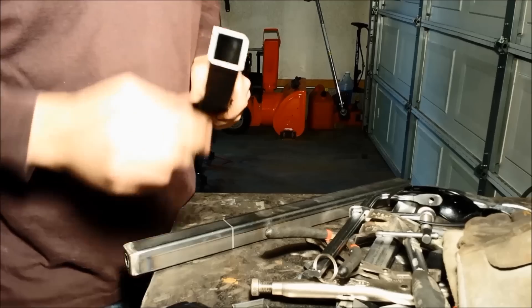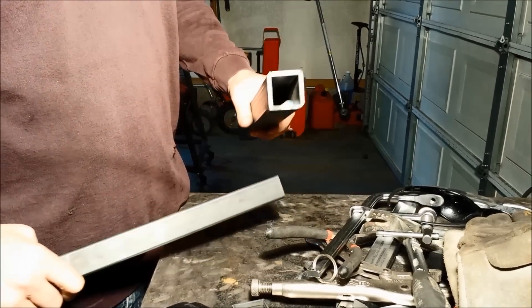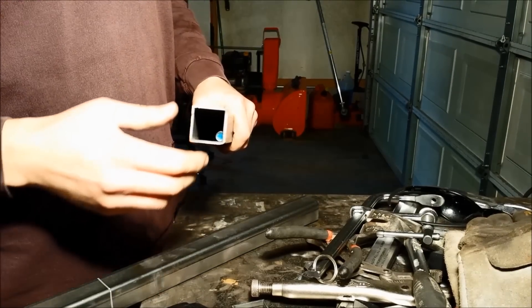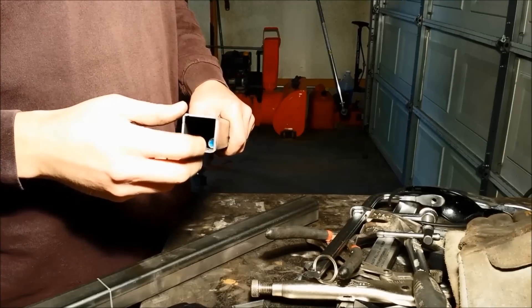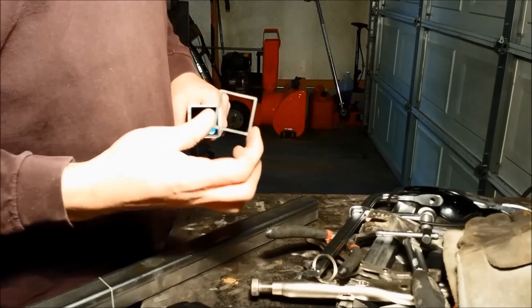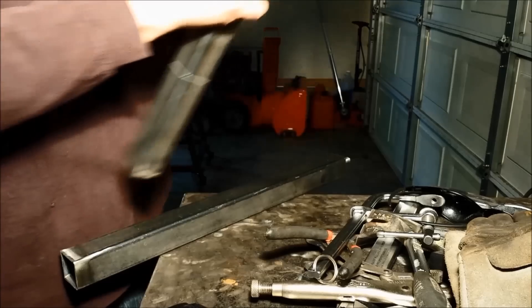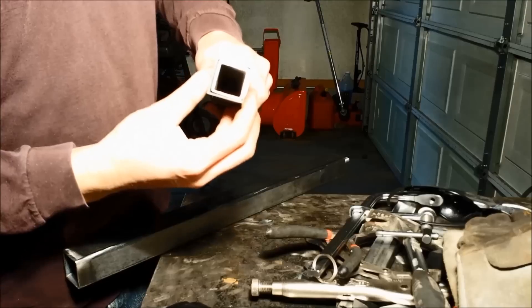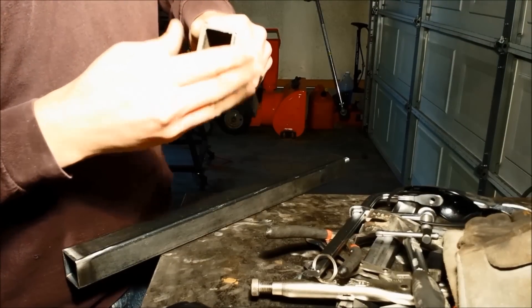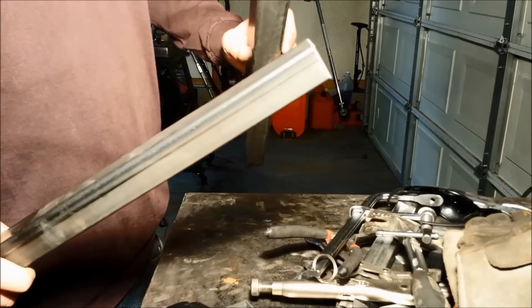The only other thing worth mentioning is the tubing. This is one and a quarter inch tubing and this is one and a half inch tubing — that was about as tight as I could find, but there was still some slop. I didn't want as much slop as I had, even though it really wasn't that bad. So I ended up cutting something similar to this on the CNC machine as a spacer. This one's actually a little large, but that one fits pretty snugly. If I have to, I can actually bend these in and weld them in place, which helps stabilize the post a little more.